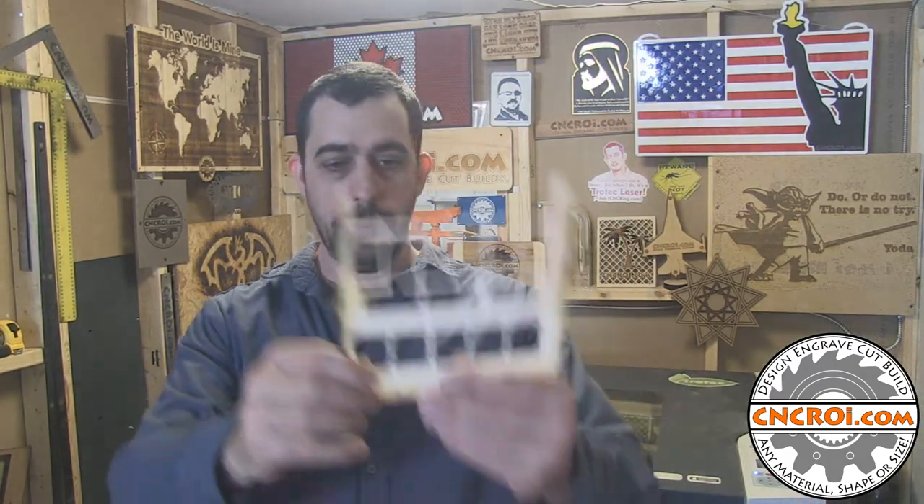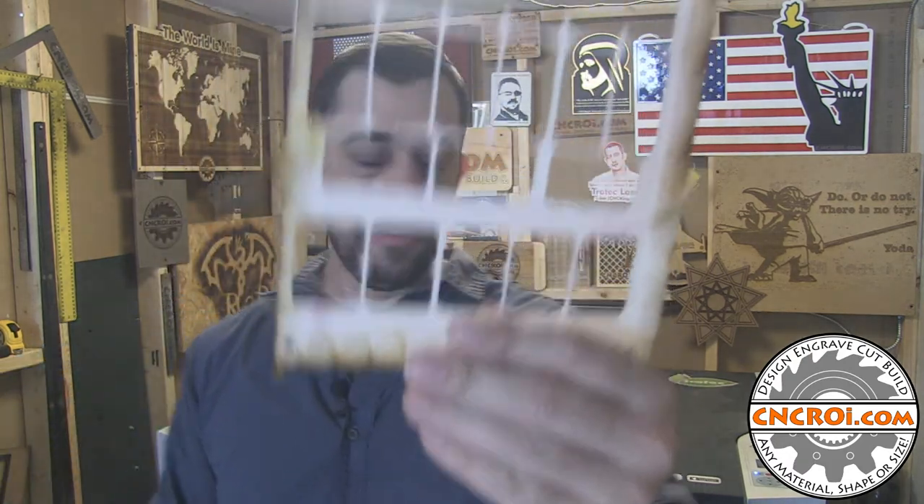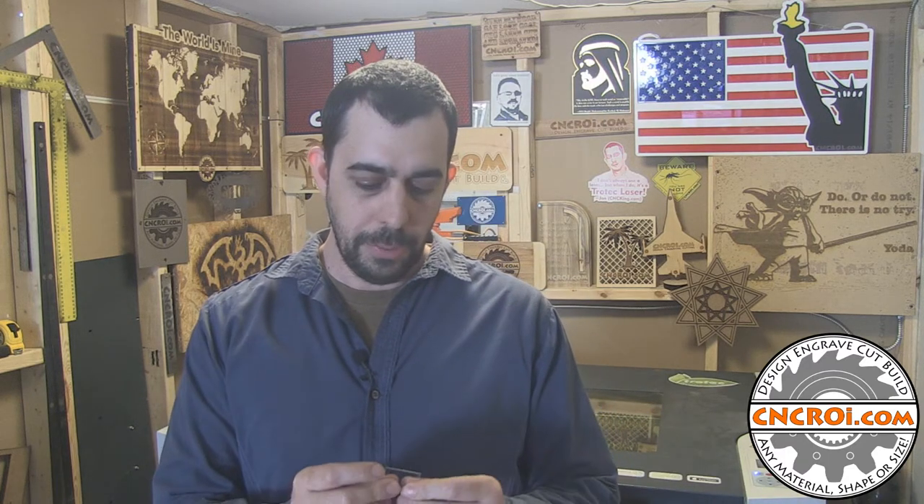The customer obviously does not want tabs on all of their parts. The quickest method to solve that problem with polycarbonate is just to sand them off. There are a few ways — one is to manually sand by hand, but I had about 50 or so small polycarbonate parts, so I thought it was more efficient to use the belt sander to remove them.